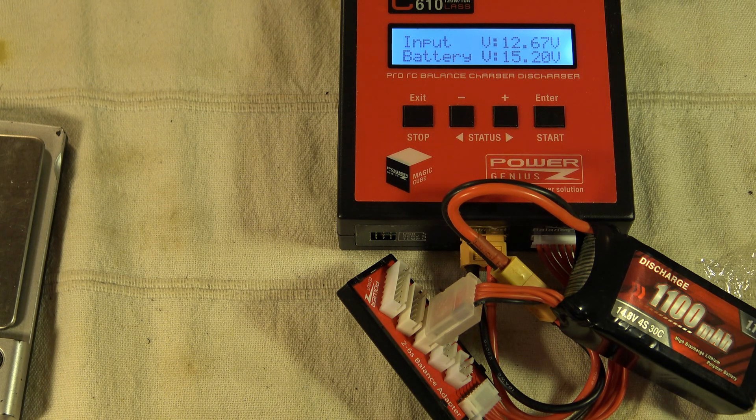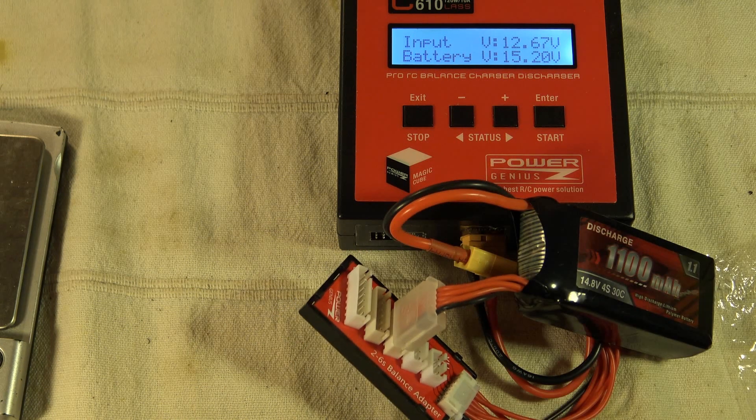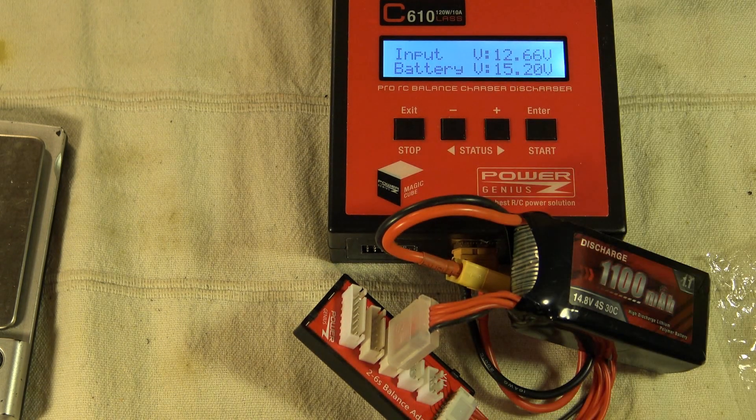You need each cell to have more or less the same low resistance value and in the same range to confirm your battery is in good health. If you see that one cell has twice or three times more resistance value, it means that cell is damaged and the battery can be very dangerous — it needs to be discarded. I hope you enjoy this new video about a battery charger. If you like it, please subscribe and see you next time. Bye bye.